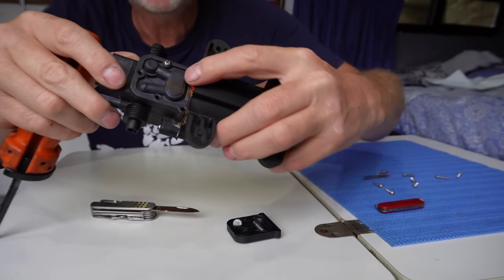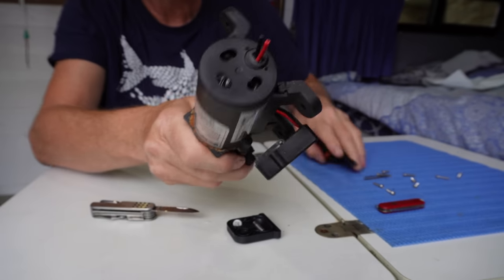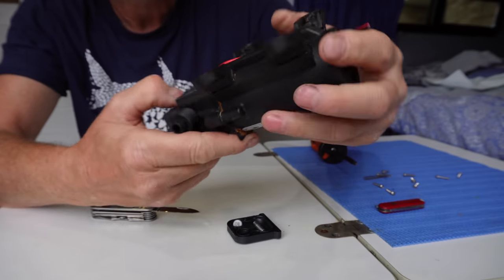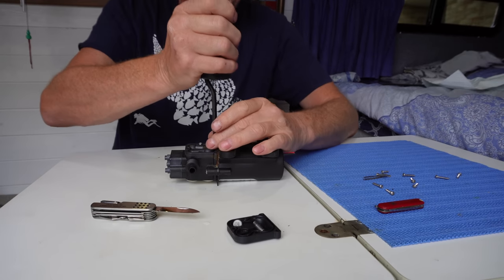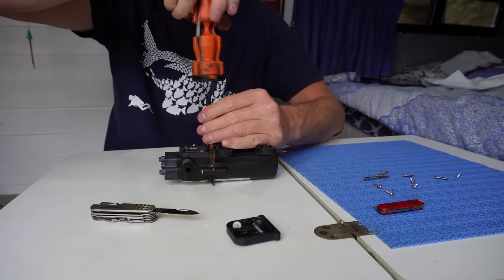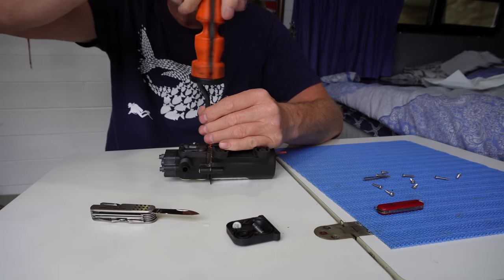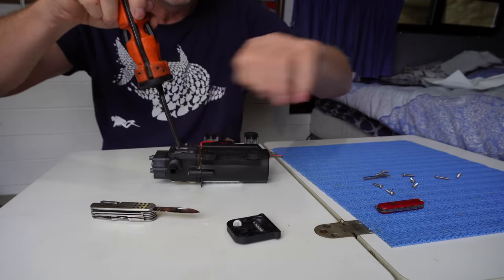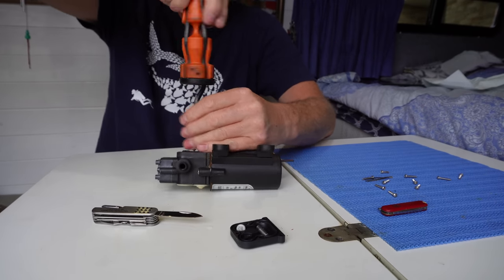Just as a side note, there are signs here that there's water escaping. There's rust underneath this seal. You can see the rust around here. Maybe it was leaking at some point. Maybe it did start leaking. So we'll take the whole pump head off, I think, off the motor. Let's just take this off first. See if there's anything under here we can see.